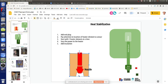You're radiating temperature away through radiant heat. It's not even conduction or convection, which is upward conduction in air. It's just plain radiation, like sigma T to the fourth in the physics. There's a formula for how much radiation you get, and it varies as the fourth power of temperature. In other words, once you reach high temperatures, once you start glowing, a lot of the heat transfer is through plain radiation. That's how radiant heaters work, like a fire in a fireplace.